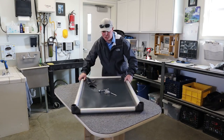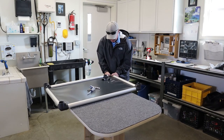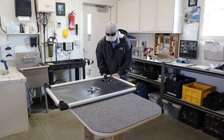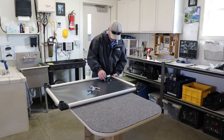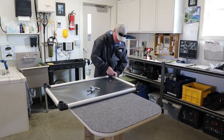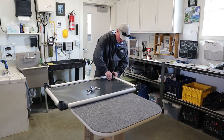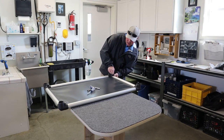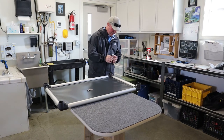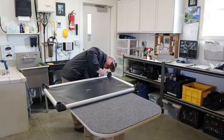Spin it around and now the last one should not give you a hard time. The reason I'm making this video is just for this point — a lot of times my clients buy these beds and I hear horror stories about getting that last leg in being the ringer. Years ago when I first started putting these together, I learned real quick that going sequentially was the wrong way because that last one is such a struggle. Now that I've got a start on all of these, I'll go back with my ratchet and Phillips head screwdriver and tighten them until it stops.